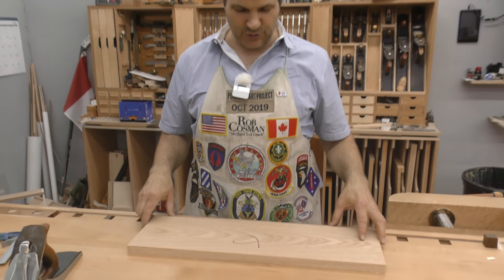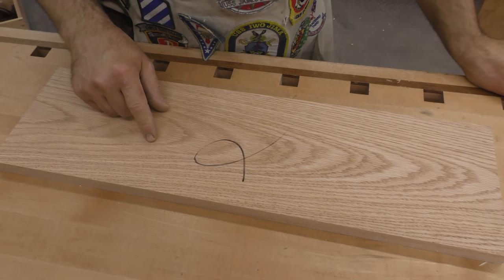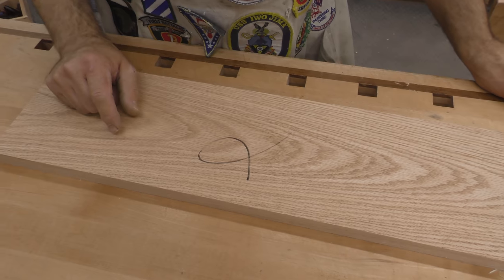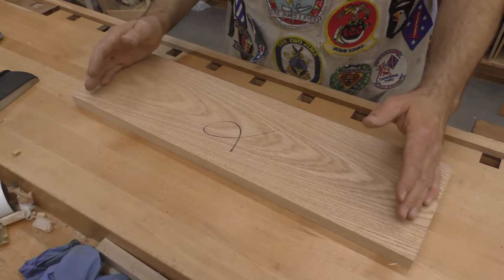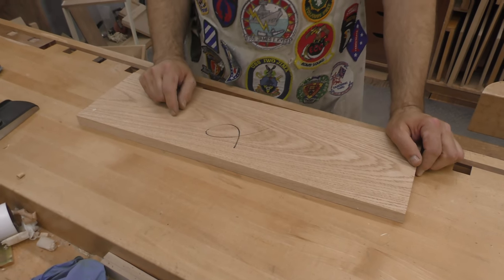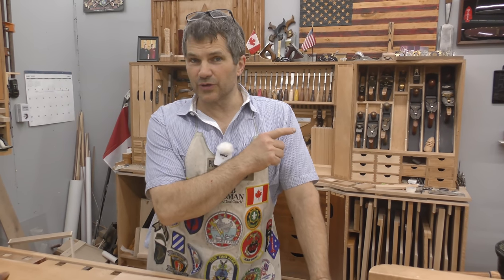This is the piece of wood we're going to use, it's red oak. I've already made this surface, which is our reference face, flat and smooth, and I verified it with winding sticks. So if you were to lay that on a flat surface it would not rock. We checked it to make sure there's no wind or twist, there's no hump in the middle. If you miss that or want a refresher, check out this video and it'll walk you through that whole process.